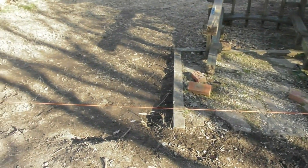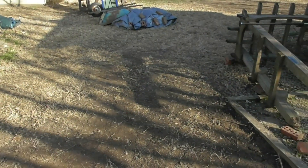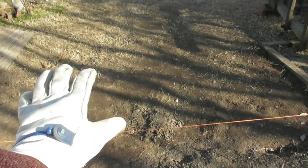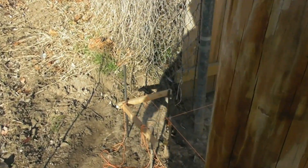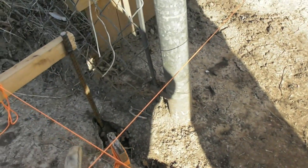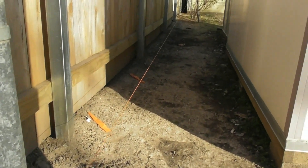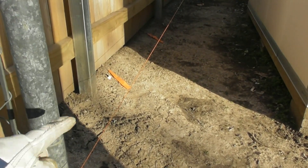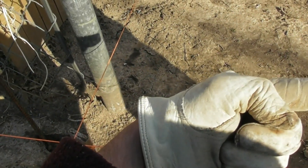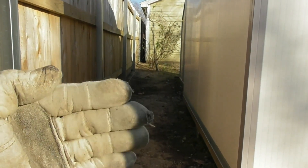I'm going out of town, under 10 days. I was doing some excavating — he dragged some dirt in here, but I had so much gravel and stuff I had to tear it all up and sift it out. I was marking out my lines. When they built the house next to me, this is the corner marker right there, and there's one way up in the front. My objective was to sneak by my shop, string line it down, crossing these, and then 3, 4, 5 off this corner to shoot back on my property. I'm kissing the edge of my trim on the shop so I couldn't get a good measurement through here.